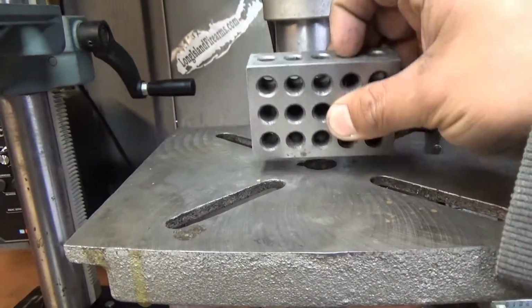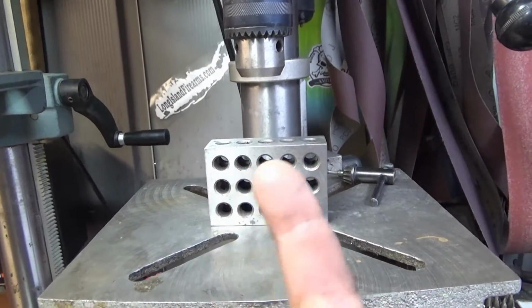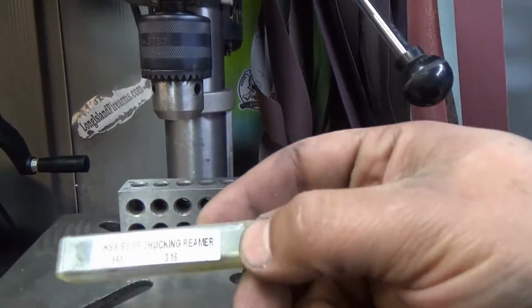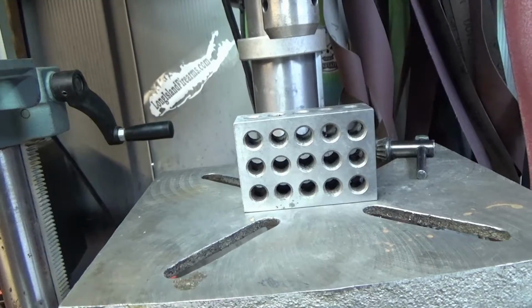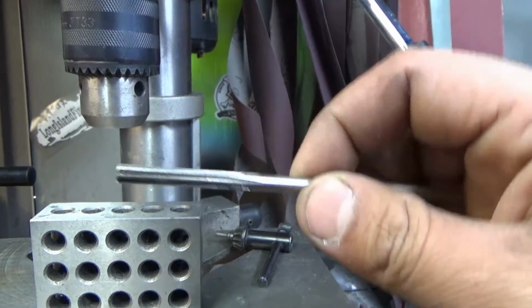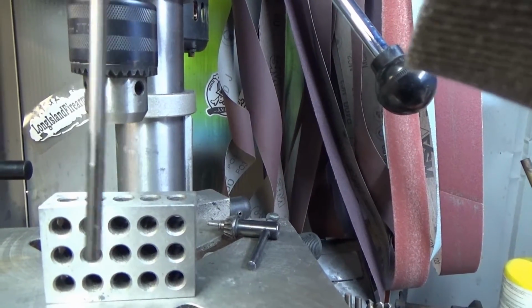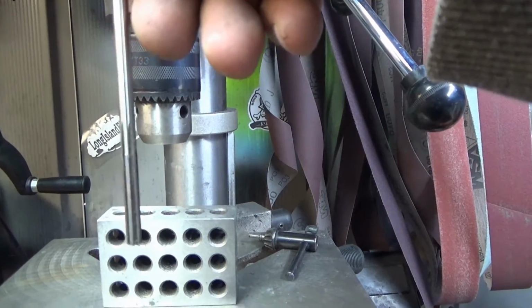It turns out the table had wandered just a touch, and the drill bit wobbles too, which doesn't help. Especially if you're using a reamer, which needs to be perfectly straight, like this one here, a 3/16 for a pivot, and the decimal is 0.1875, I believe. Now this is the reamer here, see it's all straight. If you have a wobbly press, what good is a reamer that's doing this? You see what I mean? If you have a cheap press, I mean. A quality press and it'll spin straight like it's supposed to.